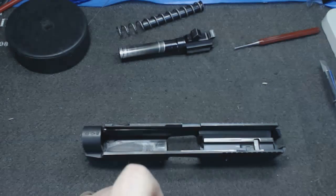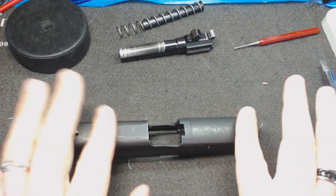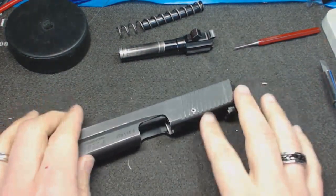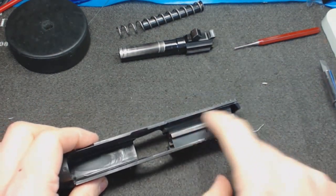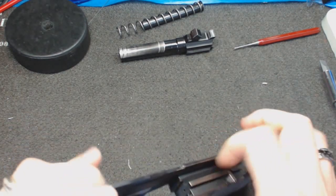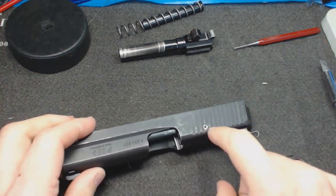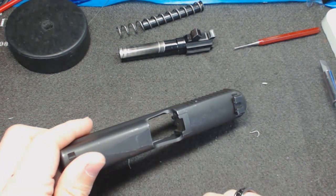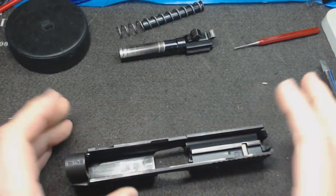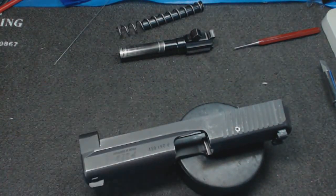Standard barrel up and out. Now, again, depending on which model you have, you may have one where the slide is all one piece of metal, and you may have this variation where there's a set of roll pins that hold in a steel block which has the breech face and the extractor and firing pin safety all built into it, which is essentially held in by that one pin into the frame. Or it may just be milled out of one piece of steel, and that whole section would not come out in some of them. And I forget which model is which in terms of that.